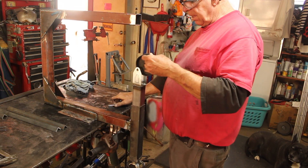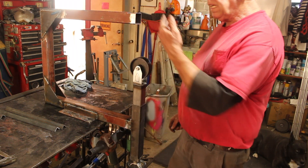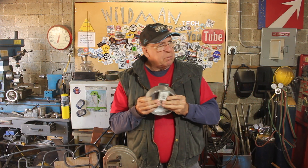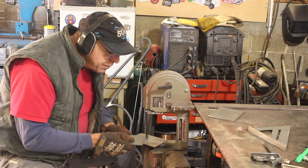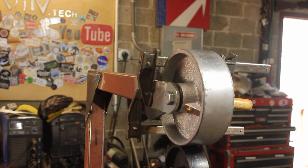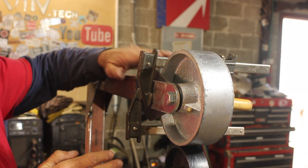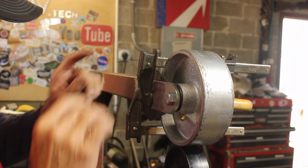This is coming together pretty nicely. We got our anvil with its elevator — all we need now is the hammer. This caster is going to be the hammer wheel; I've already cut it off its little swivel gadget. Now what we need to do is make some gussets to attach it to the boom. I'm going to make those out of this 3/16ths plate. I made these semi-diamond shapes because I think I'm going to reinforce this up here on top and bottom by boxing it in as well. There's my hammer and anvil looking just the way it should. We'll tack this together, weld it up, and then I'll show you how it works.